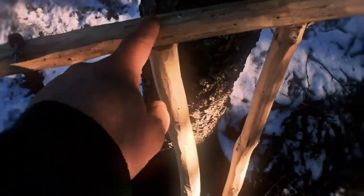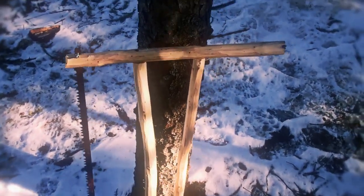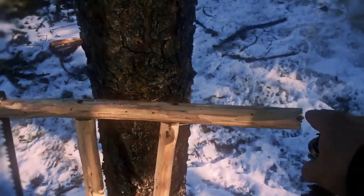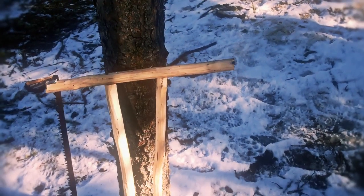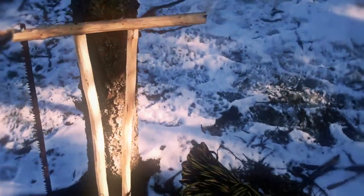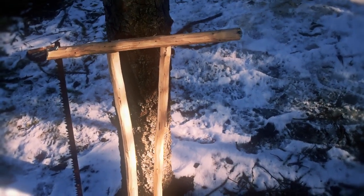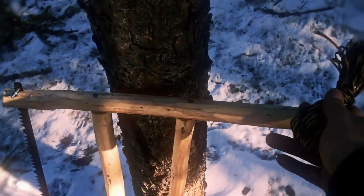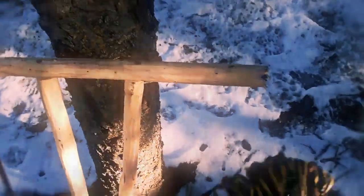So there's my completed saw frame. Just a couple of little nails there and there, bolts there and on the other side. That makes me think it might be smart to add nails and a couple of bolts to whatever kit you're putting together. Now to tension this, we have to put tension up here, and you want a non-stretching kind of line for that. They found some baler's twine that should work. The amount you need depends on the strength of the line — this isn't very strong line, so we have 12 arm spans.